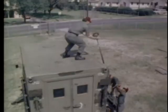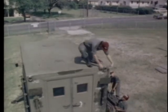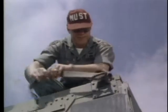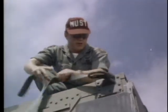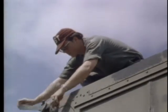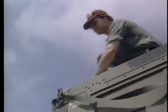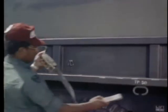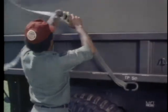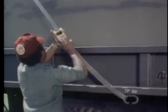Place the equipment next to the metal chests for packing. During transport, the container must be secured to the truck with sufficient tie-downs to prevent shifting or movement. Run one tie-down through the rings on the rear of the container. Attach each end of the strap to the tie-down rings on both sides of the truck. Tighten the strap with the latching device. Secure the loose end of the tie-down.